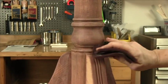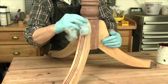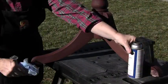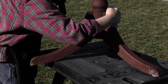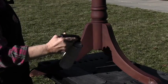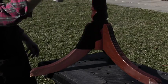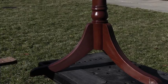Use a maroon pad to clean and smooth the deep coves of the rest of the pedestal. Tack off the pedestal and apply the mahogany wiping stain. Allow to dry. We are finishing the top of this table by spray, so I want the base to have the same look of a sprayed finish. This can be done with aerosols. Tack off and use an aerosol sealer outside. Light multiple coats and a can handle makes the job easy. Apply the aerosol top coat in the same manner.